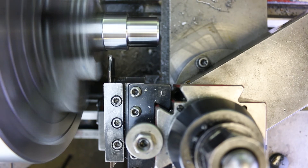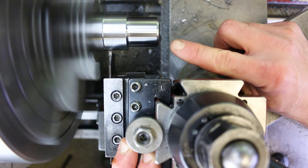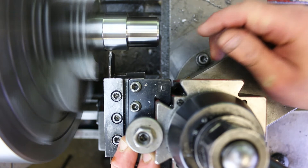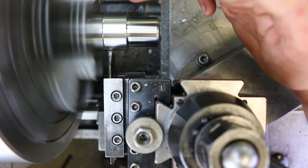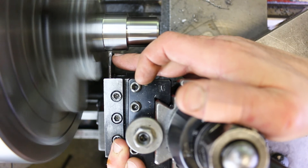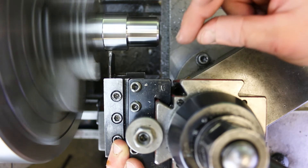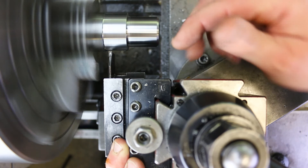Anywhere between an inch and five eighths and an inch and three quarters will be good here. Do a quick spin test to make sure I'm not going to destroy anything — that looks fine. Turn it on and go straight in. The part-off tool is very similar to a grooving tool with a couple of differences. It's mounted to the end of a blade held in its own holder — loosen the screws and you can move the blade in or out to part off larger or smaller diameters. You want the minimum stick-out to keep the tool rigid. The insert is designed to curl chips inward into a tight curl so the chips get out of the way and don't bind up on the sides of the groove, which would cause the blade or insert to break.